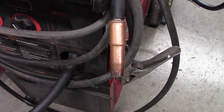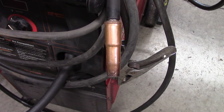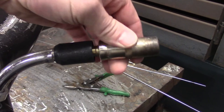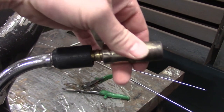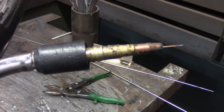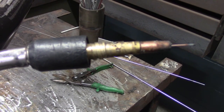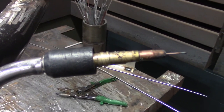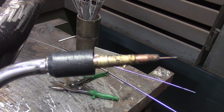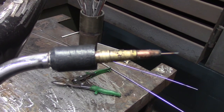Now to find a threaded one — I tried to get rid of all the threaded ones because we keep cross-threading them, but there's got to be one here. This is the last nozzle we're looking at — you can see I'm just twisting it off. The threads almost look like Acme threads. What they've done here is made the threads thicker so you can't cross-thread it as easily. You only have to unscrew it about three times and it pops right off. It's designed to combat the cross-threading problem.